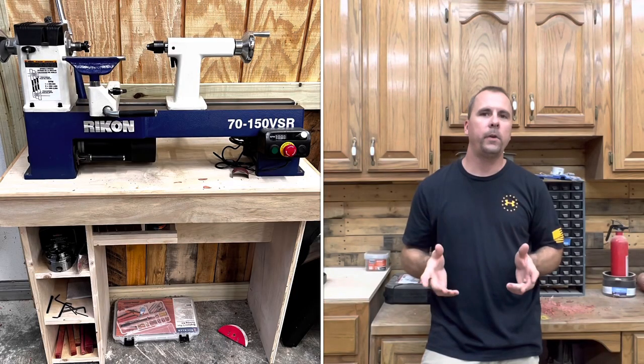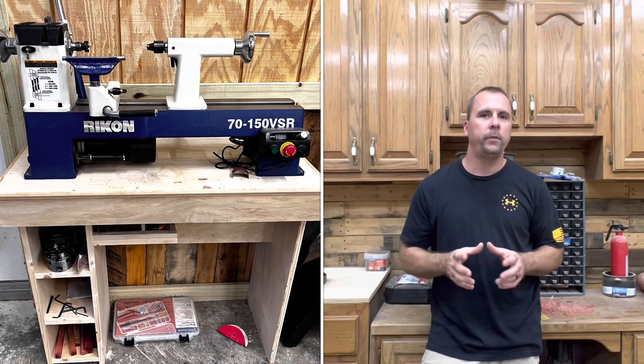It's just a couple of plywood scraps and some trim — that's all there is to it. I have mine screwed to the wall, so you might want to consider that if you're building one like this, because it's not very heavy. If you are going to build a lathe stand, you want it pretty heavy, because if it's not, the lathe will shake when you put a big chunk of wood on it. So let's get started.